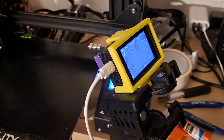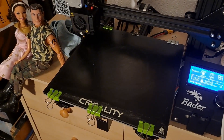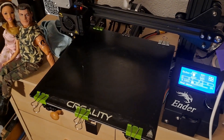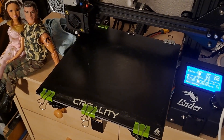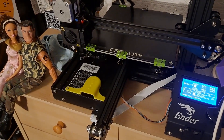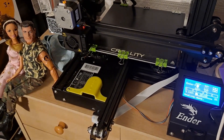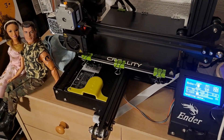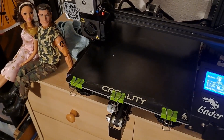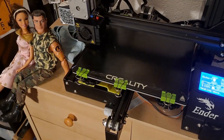We are time-lapse filming it. We're going to print four tyres all at once. I probably ought to just print one at a time, but watching these videos, there can be a problem - you actually need the filament to cool down between layers. As I say, it gets very confusing. They all got their own ideas. So we're just going to go for it, see what happens. I'm printing slower than normal, just 20.